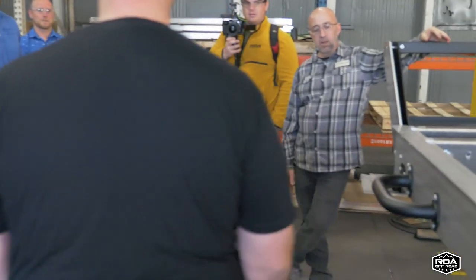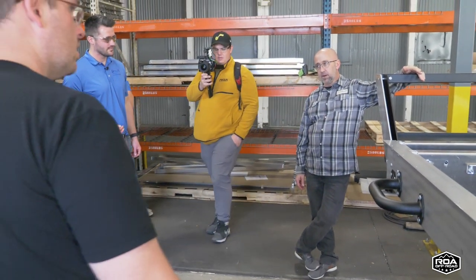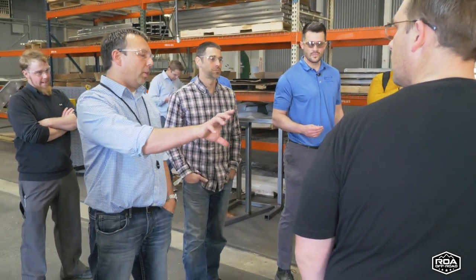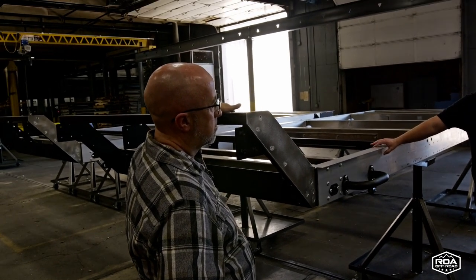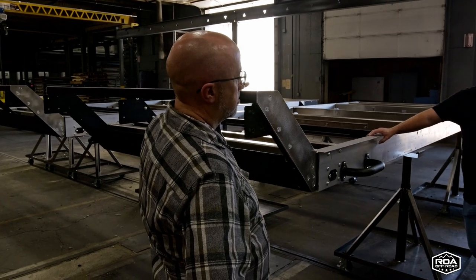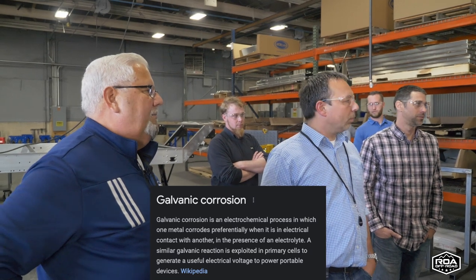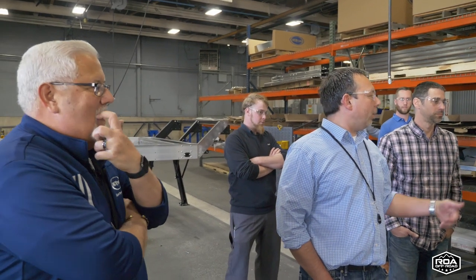Is this steel or aluminum? Steel. This is steel. So, steel bumper and powder coated. So, I know questions that we've gotten before, Ben, were steel on aluminum. Can you talk about that? Yeah, again, it's all powder coated, and that applies the separation. Yeah. So that's where we're at right now. So there, he's referencing then, in engineer's terms, is what? Galvanic corrosion. Thank you. Galvanic corrosion. That's what you're referencing. So why do we not have to worry about that? Well, it's got to have a surface that is open, allow that current as well.